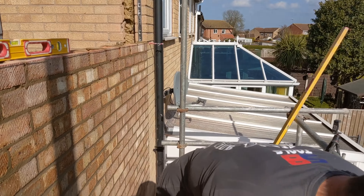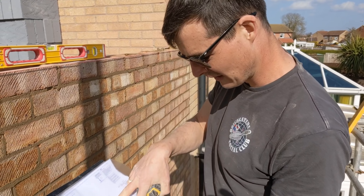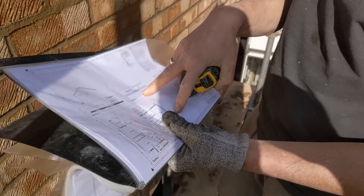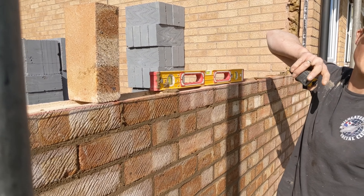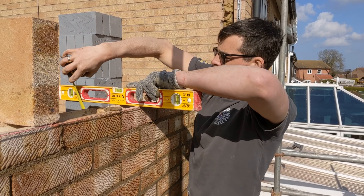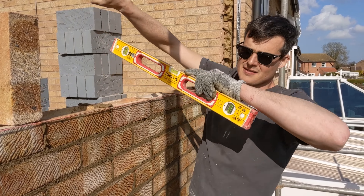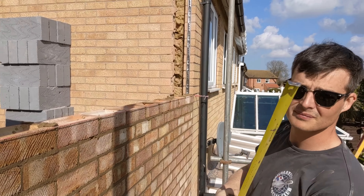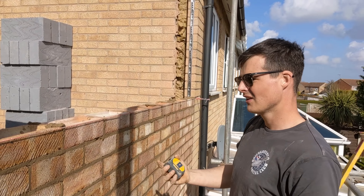Have they not told you the dimensions of the window? No. Not even the materials? No. On an extension it's kind of open to interpretation. I've also not got a height. Normally a standard window is 900mm from floor level — so if I measure down, it's normally 900. But I also want to match the existing house — I want my windowsill to be the same level as that. So I'm going to whack the window here and I'm pretty confident it'll be alright. That's the thing with extensions — it's just like make it up as you go along, but it'll be alright.